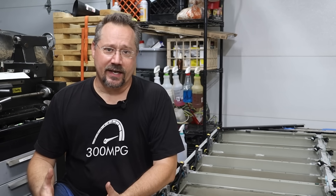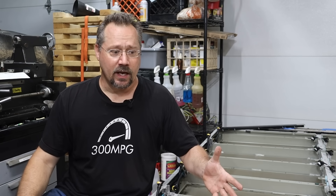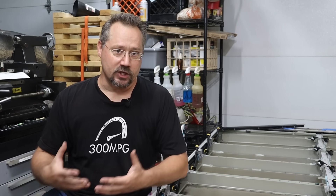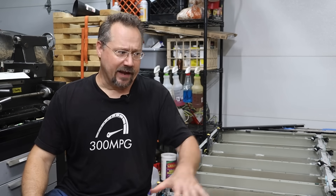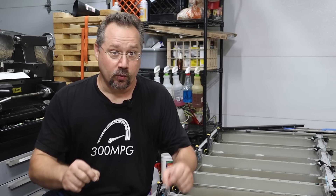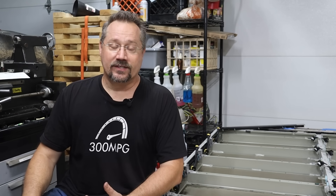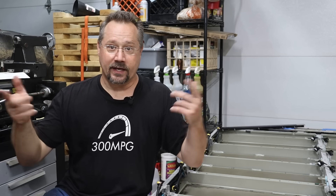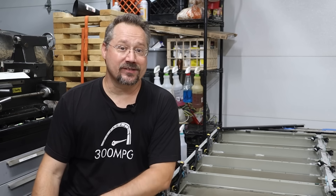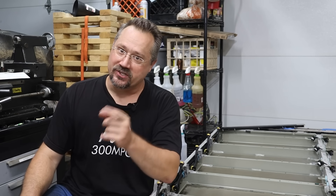Big picture, it looks like this was essentially a design flaw. This was only the second year that the Tesla Model S was made, and they've changed it since then. The new spec actually has solid plugs at Module 7 and 10 in front, right behind the front wheels, and then all the other modules have a lot fewer umbrella valves, a bunch of plugs, and also a Gore breather valve. So what I'm going to do is just order the current parts and get them installed. Then I can start working on everything else for putting the battery pack back together. I hope you like these videos — please like, comment, and subscribe, hit that notification bell, and until next time, stay charged up.